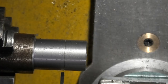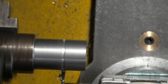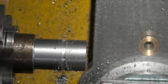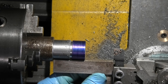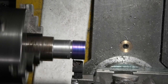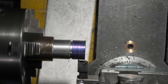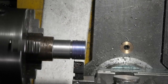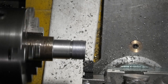I'll take the sharp edge off the corner, just making an undercut for the end of the thread. I'll set the thread cutting tool square to the part I'm making. Now's the time you can check you have the right pitch.